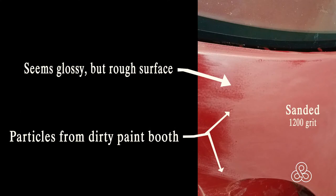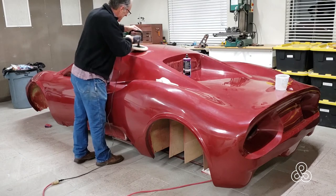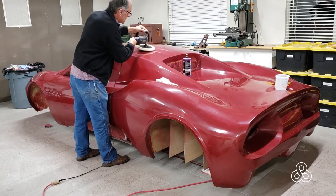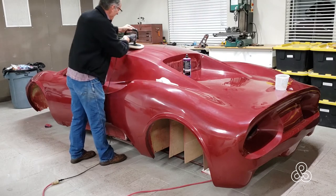That super glossy painted surface is not as smooth as you think it would be. After taking a 120 grit block and working it over, you'll see there's a little bit of an orange peel to it and some flaws. Those can just be taken out with that sanding block — work the whole surface over, get it all knocked down to a flat surface, and then go back to polishing it. We're not after a perfect show car finish; we're just after a perfectly smooth surface for taking the mold off of this paint. This was a metal flake paint, and once you sand down the flakes, they just don't look right anyway — but we're not worried about that. We're just after smooth and glossy for a perfect mold.